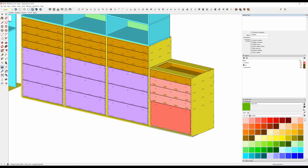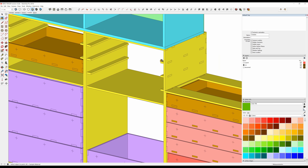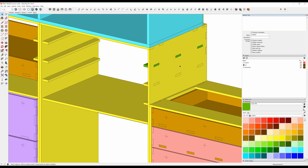The different colors designate different size drawers. This red drawer is going to be doubled up with full extension slides for pretty heavy stuff. These purple ones are in the individual drawers for heavier stuff that need full extension slides. All the other drawers are not that heavy — so it's just going to be wood on wood, which isn't that bad at all. The drawer runner itself has three tenons that go into those mortises I showed you. If I hide this, you'll see that the three tenons stick out, and after the CNC machine cuts it, they literally just clip together — a little bit of glue, a clamp, some brad nails, and you're done. Assembly is incredibly fast with this style of construction.